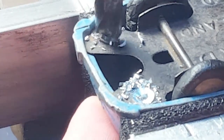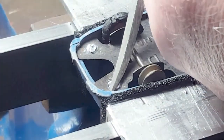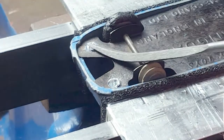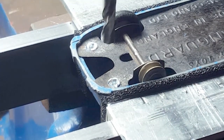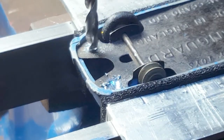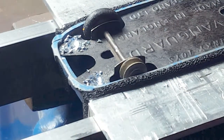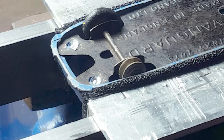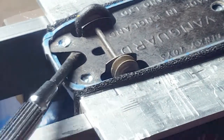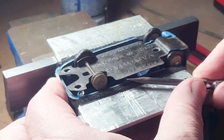It keeps slipping off of the rivets. Both back rivets, it's not on center. So I'm going to file down the part that's still sticking up, and maybe I'll be able to get the rivets drilled out. Okay, that's a little better. It's a tricky thing to figure out how to get these so you're drilling on the center of the rivets. So a little leverage with a screwdriver and up it comes.